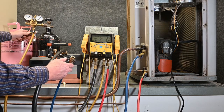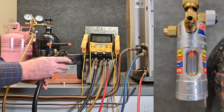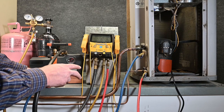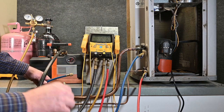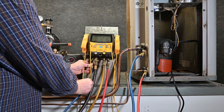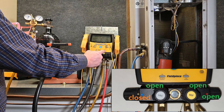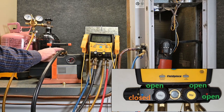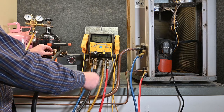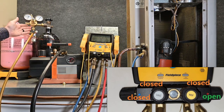Because it's a little loud I have too much pressure, so I'll drop this down. We can see the ball is kind of bouncing around just a little bit at the top — that's about what we want. We're going to let this run for a couple of minutes to push out any leftovers and moisture that may have gotten in. I left this loose for only an hour specifically to allow some moisture to get in so we'd have something to check. After purging with nitrogen, I'm going to put the connector back on and also open the vacuum valve, allowing nitrogen to flow straight across the manifold gauge set through this hose, pushing out right here at this point. I can close this valve off — we've now purged out this hose. I'm going to close everything back off and, since we're done purging nitrogen, take off the nitrogen hose.